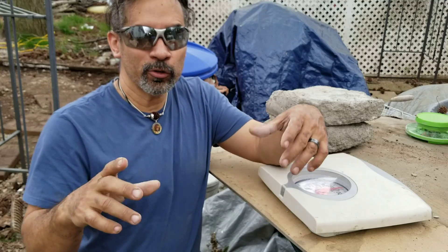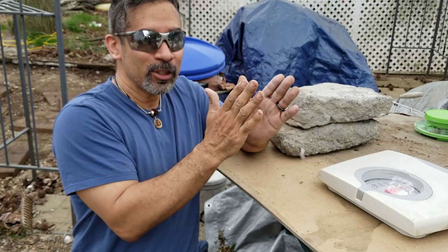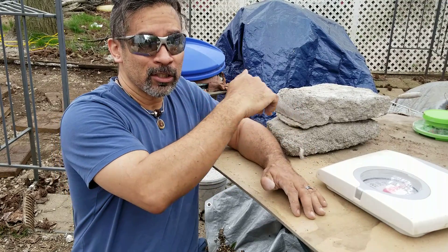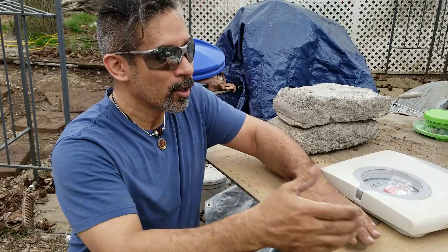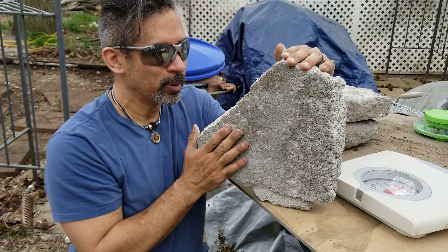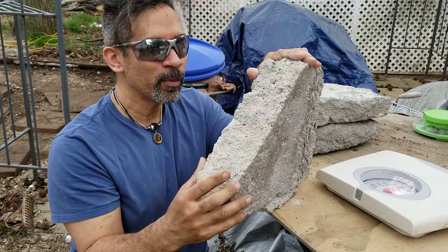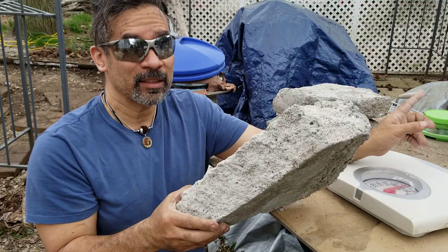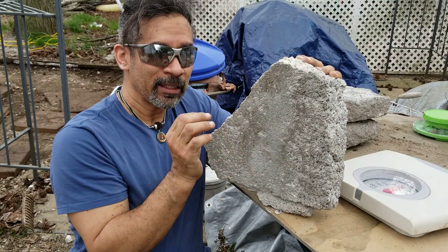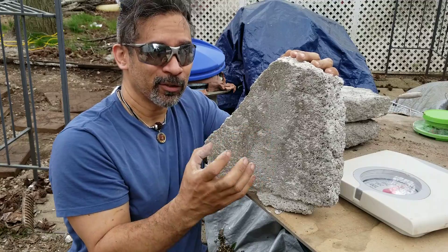For the dome I'll be inflating two air forms, and the cavity space in between them will be around six inches. I plan to fill that six-inch cavity with regular air crete — just Portland cement, no sand. Once that's complete, I'll put a mesh on the outside and on the inside of the dome, covered in a magnesium-based cement. That's my idea for creating a dome of air crete while having the structural strength of the mesh with a cement that cures to 9,000 PSI.